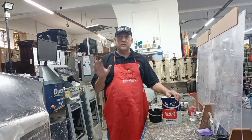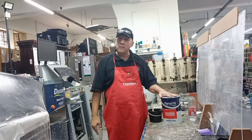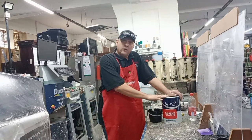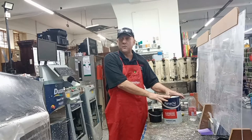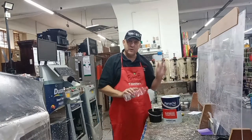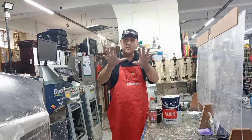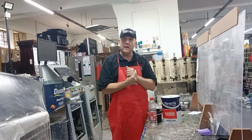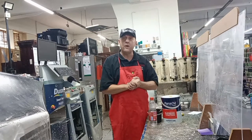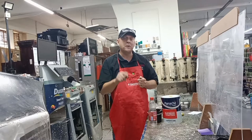We've scraped, and now that area is dry — we've let it dry out — and I'm going to prime it with damp sealer. I prefer an oil-based damp sealer. There are water-based damp sealers on the market, but follow the instructions. With our solvent-based, which is a turps-based damp sealer, we thin the first coat 10% with turpentine. Add just a little bit of turps to your damp sealer, mix it up well, and that first coat thinned is for penetration into that raw area. We leave that overnight, and then we put a second coat of damp sealer, unthinned, before leaving it for another 24 hours before we finally paint over it.